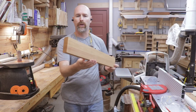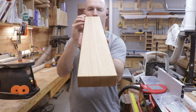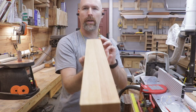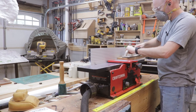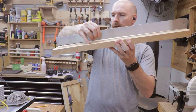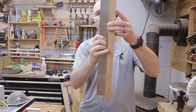The next board is a piece of Honduran mahogany — clear grain mahogany I'm going to use to build a ukulele neck. It's about two feet long and an inch and a half thick. It's pretty square already but has just a very subtle cupping and maybe a hair of twist. This is the longest board we've done so far. I only made one pass and it essentially removed all of the pencil marks, so it must have been really flat already. The tool had no problem with the mahogany, which is a very hard wood but pretty easy to hand plane as well, and it's very, very flat using this straight edge.